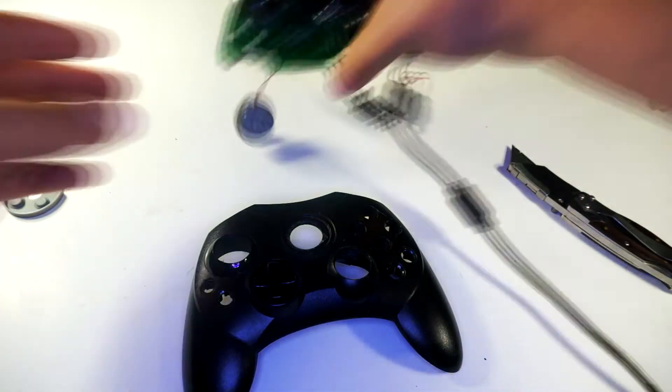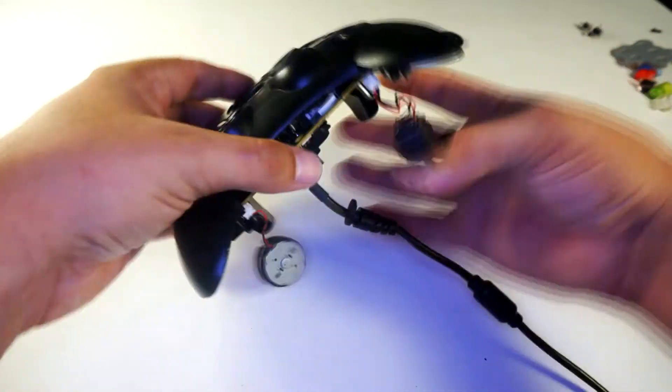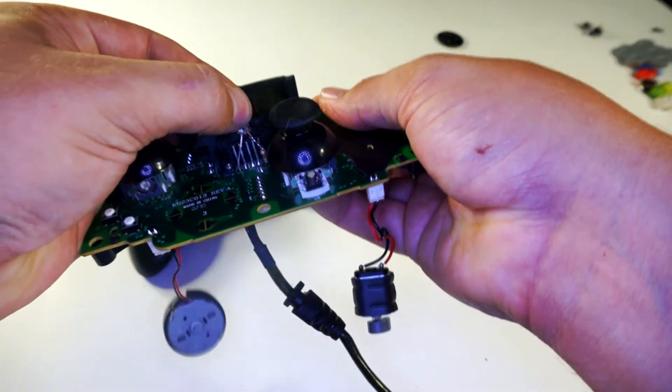Take your circuit board and put it in place and line up your LED with the center of the jewel. A good way to prevent hot spotting would be to diffuse your LED, which can be done by sanding it with a little sandpaper, which I ended up doing later.